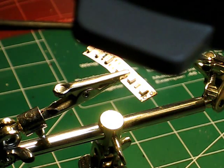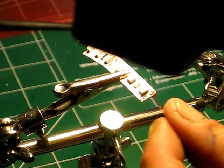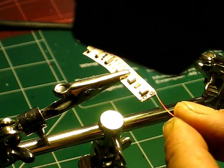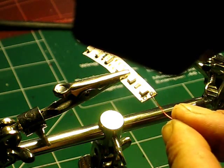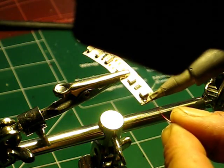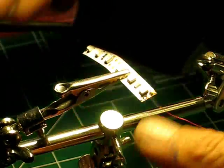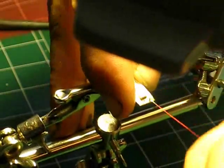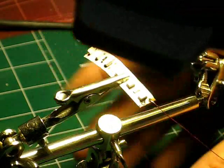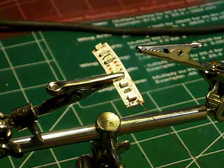Having this wire tinned already, you just want to make one quick swipe. I can see by looking across here that my polarity is positive on this side, so I'm using my red wire. I'm just going to hit this real quick — you've got to hold your hand steady for a second. That's basically it. That's a really good hard contact on there; I would actually rip this whole contact off trying to pull that wire off — it's a good solid connection. That's what I'm doing to solder these up.